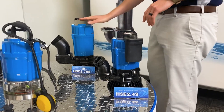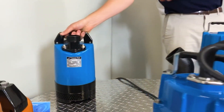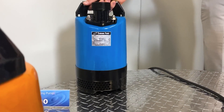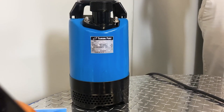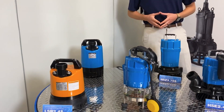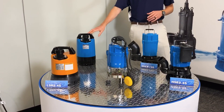Again, we have a 2-inch and a 3-inch — this is half horsepower and one horsepower. Moving on to the LB series — these can be kitted with the automatic electrode as well. This is a 1-horsepower, 2-inch pump with a top-flow design. So if it is ever in a run-dry application, the air will actually continue to cool the motor even if the water is not there to cool it. These LBs are available up to 2-horsepower with our LB 1500.